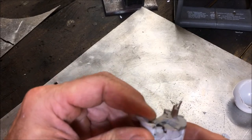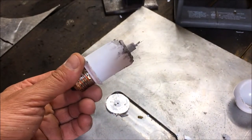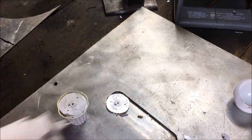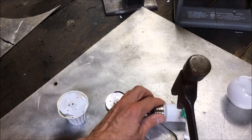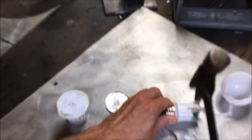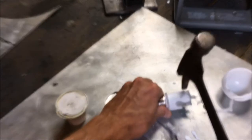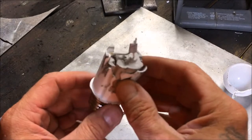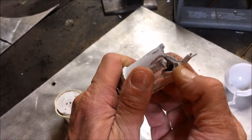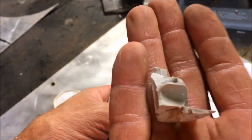Aha. There's some of the capacitors I was worried about. I guarantee that's what's going on here, guys. There's gonna be a current, voltage doubler circuit. It's connected to a high voltage transformer. It's all rubbery. I would imagine this is that thermal rubber compound that they use in heated coffee mugs and stuff. It actually transmits heat very well. Yep, there's the transformer.